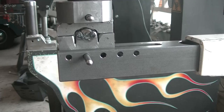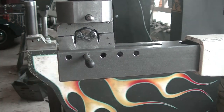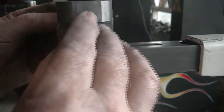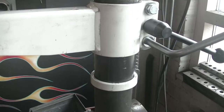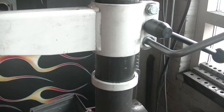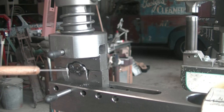With the dies ready and the 5.1 mm holes drilled, you can put the pins in and secure them with the rubber cap. My Mechammer is equipped with the new height adjustment system, which is very handy with the custom dies. As pointed out, there are 2 slots in the lower die to guide the profile you need to make.